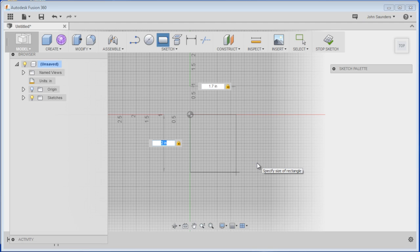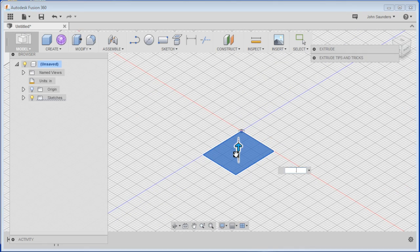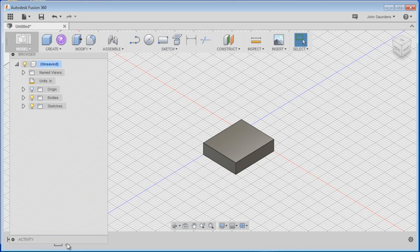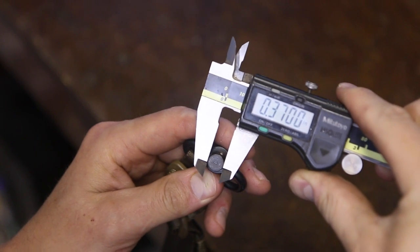Let's create our material and workpiece here. It's going to be 2 by 1.7, and we're going to press-pull that out to 5. Let's put a circle in there. If we measure the sling, we can see that the OD of the actual steel part is about just a hair under three-eighths. But then if we measure the ball detents, they're about .43, so we'll blow that out to about .45 just for a hair of clearance. What we also need to measure is that little distance to see how much shelf we want left before that wider groove starts, which looks like about .045 should work.